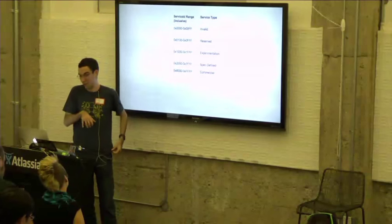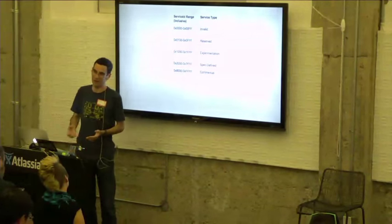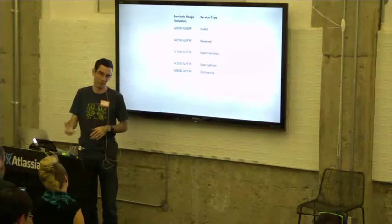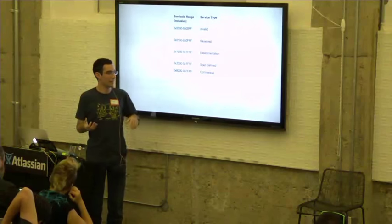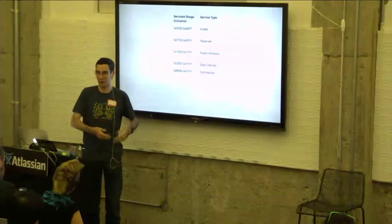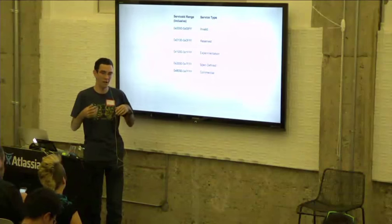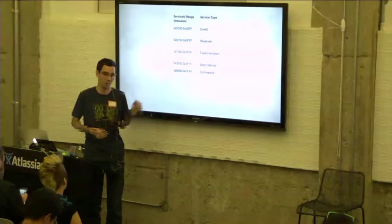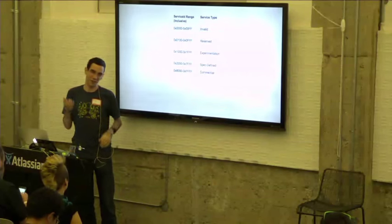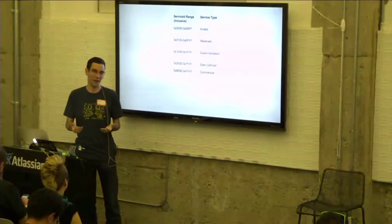The main range you might be interested in is the experimentation range. Basically, we don't care what you do in that range as long as it's for prototyping, hacking around, or development. If you made a smartstrap and wanted to productize it, you would contact us and we would give you a new service ID that belongs just to you in the commercial range. That way, if you see a smartstrap with that service ID, you know exactly that it's your smartstrap and exactly what it supports, because you made it.